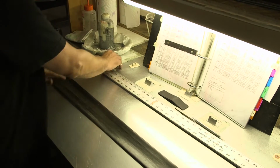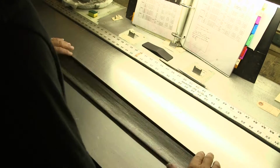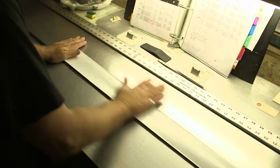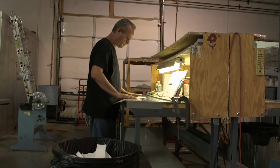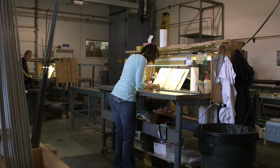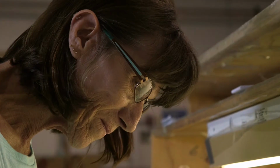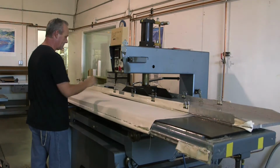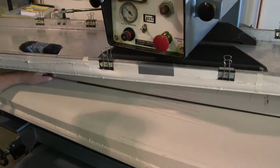Great. The first step takes place in the rolling room, where we actually turn carbon fiber into a tapered hollow tube that becomes the fly rod blank. A fly fishing rod is a very particular type of instrument, a fact that Scott is very aware of. They've pioneered a technique where different kinds of graphite are combined to form the blank of the rod. This ensures that it's firm and strong, but also has the right amount of flexibility and recovery.